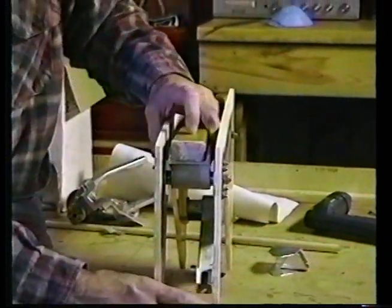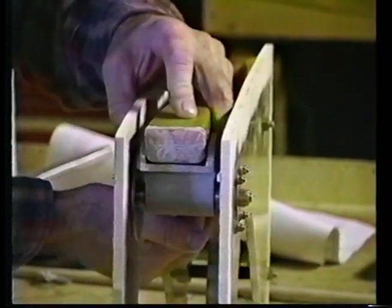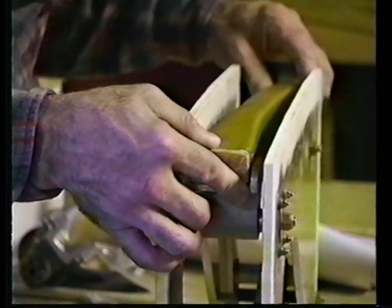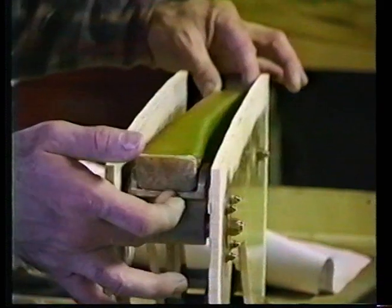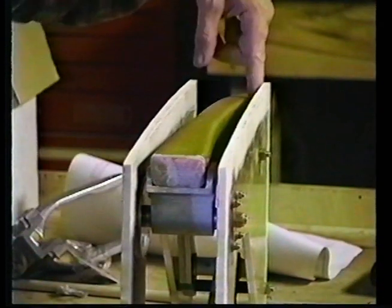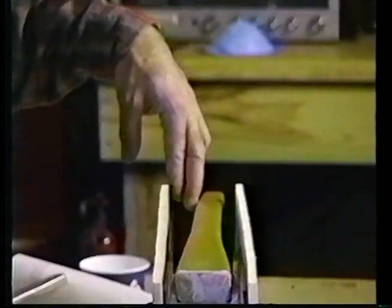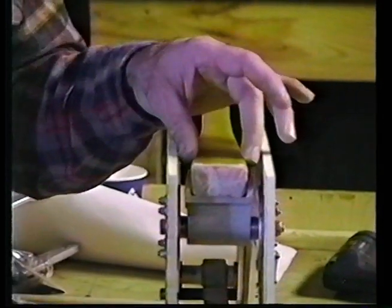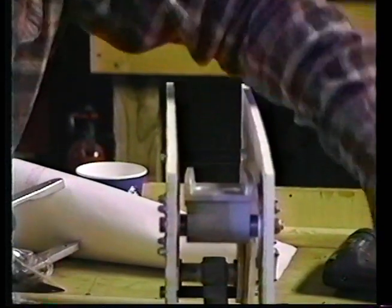You have it stick beyond the casting about 3/16 of an inch here. But when it's tucked all the way back and in, and this condition did not exist before putting glass on it, there was enough flexibility for you to easily center this when this distance was correct. Well, now you can see I have very little distance on the right side and tremendous distance on the left. So to be able to recenter this, either I grind the strut or I file the casting.